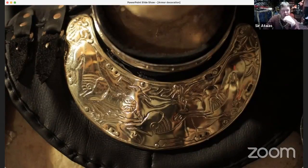I decided to dish that first and then chase it. But because I have pitch and a pitch pot or some other vessel that can hold the pitch, it's easier for me to do that. If you aren't willing to spend the money for, say, red pitch for repoussé and chasing and all that, then I would say do it flat, dish it afterward. None of this is pierced, so it'll be fine.